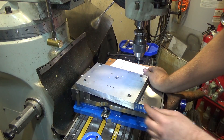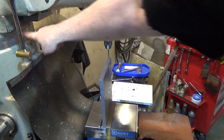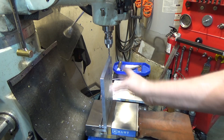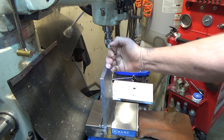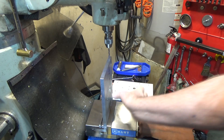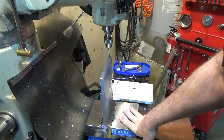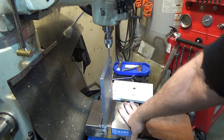Next step is the one I can't come back from very easily - separating these plates so I can work on the other side. Mounting parts vertically is always difficult when you don't have a riser which would give me another six inches or maybe a foot. This material is over .5 thick - it's .514 and very consistent. I guess they intended you to machine it down to exactly .5. I'm going to bias the hole so it's a quarter inch from this edge - the important dimension is on the inside where the shaft goes. I had to use a carbide drill bit because I didn't have any stubbies in regular high-speed steel, and otherwise it wouldn't fit in my smallest drill chuck.